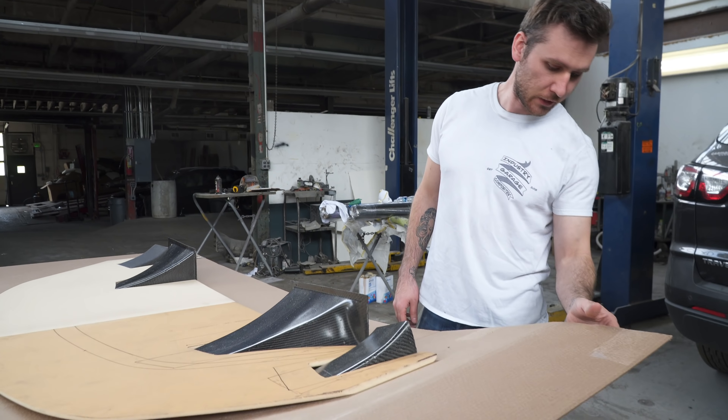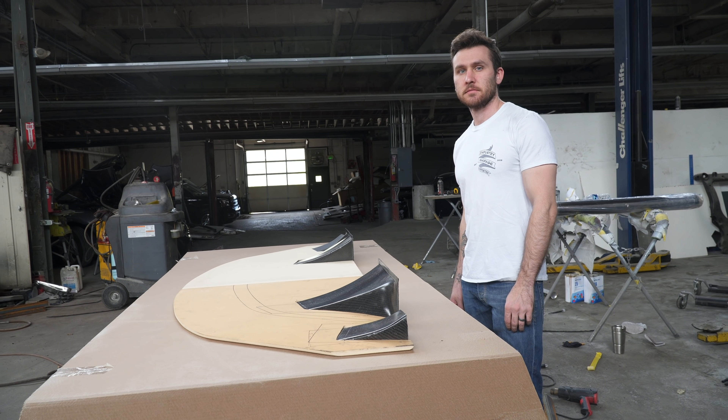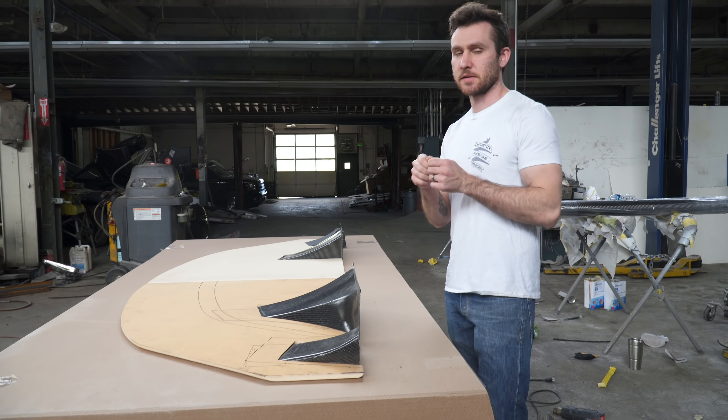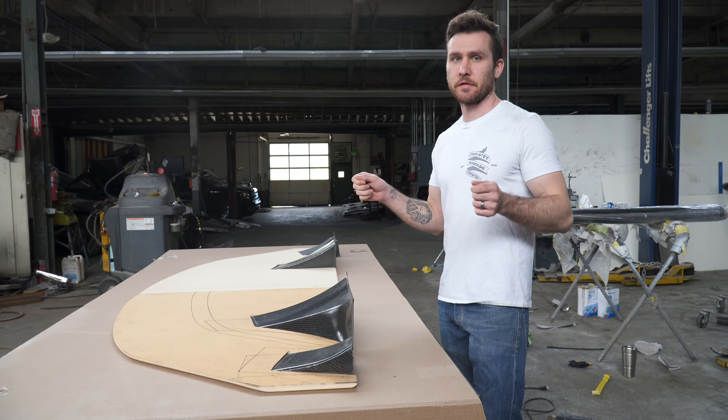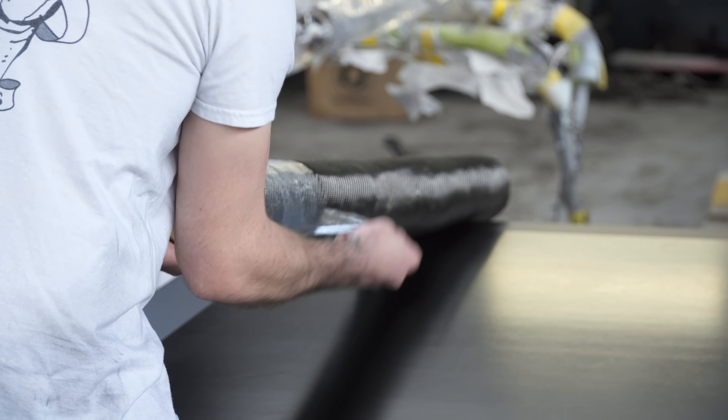Underneath this is my piece of Alumilite. I've already masked off like a 3 or 4 inch border around it and PVA'd everything else, so there's PVA on it and we can start setting up all the stuff for a vacuum bag. It's going to be flipped over so it's going to be carbon first. For those new to the channel, PVA is just a release film — it's almost like a cellophane when fully cured, a really thin sheet so your part doesn't stick to your mold. This isn't technically a mold, it's just a piece of flat Alumilite, and it is water soluble so you wash it away.